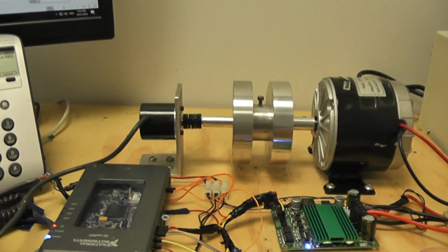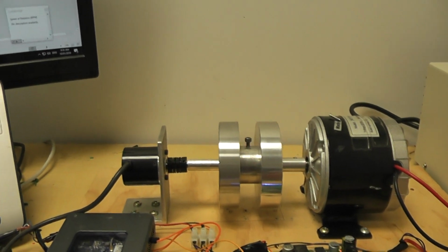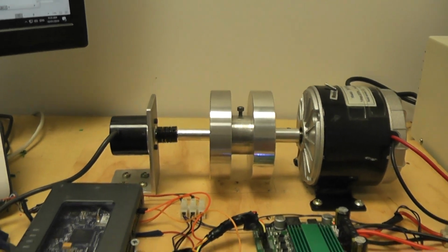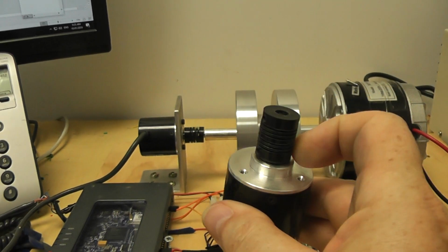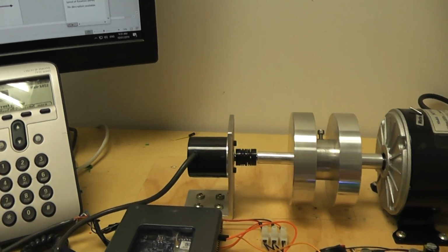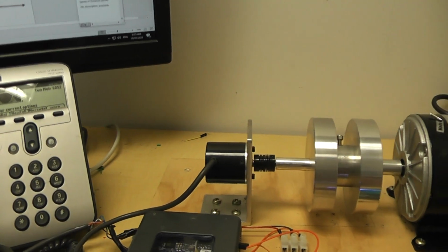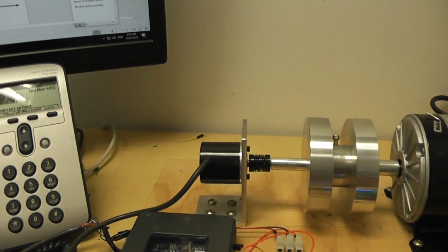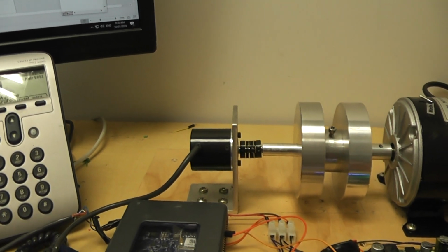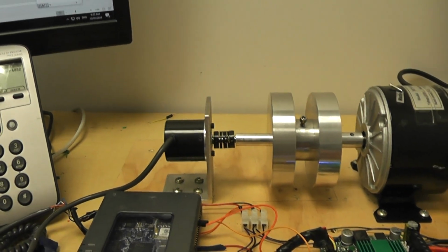But this is rather interesting that you don't have to treat the two subjects separately. It used to be in textbooks you look at position control, you look at speed control, two separate things. As long as you have a couple of integrators in there, you can track a ramping input. Both can be one, and you only need the one sensor as well, so you don't need a tacho like you used to in the old days. You don't even need to differentiate the signal from there to get speed, because we just put a ramp in instead. And the ramp is never ending, it can go on, well, indefinitely.